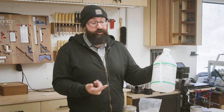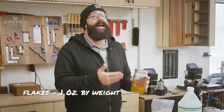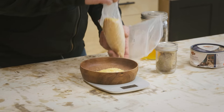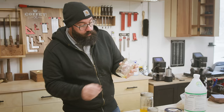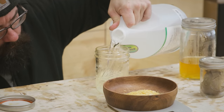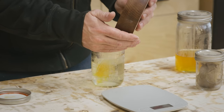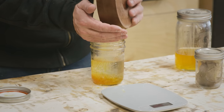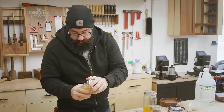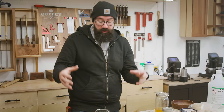The other part of the shellac formula is denatured alcohol, so you just need flakes and denatured alcohol. I like to make mine at a one-pound cut, and all that means is you do one ounce of flakes for every eight ounces of denatured alcohol. I'm going to put one ounce of flakes in here. I like to use a little mason jar because they have the one-cup measurement on the side. I fill it up with denatured alcohol — it doesn't have to be incredibly accurate, just pretty accurate — then dump the shellac flakes in, seal it up tight, and give it a little shake. Check on it every 30 minutes or so and give it a shake; the denatured alcohol will break down the shellac flakes into one consistent liquid.